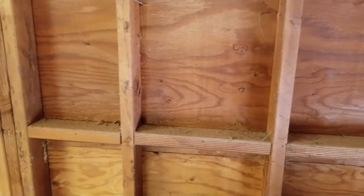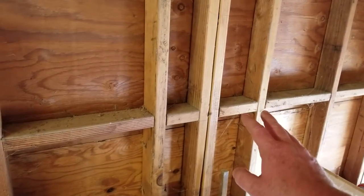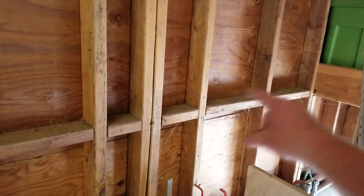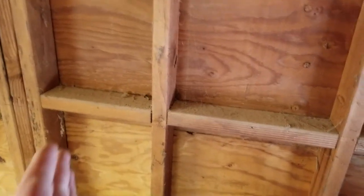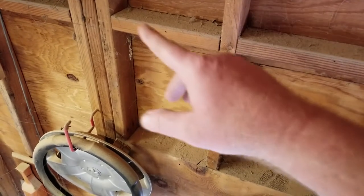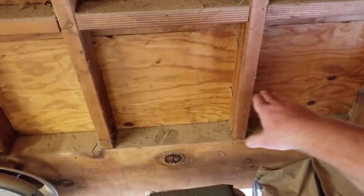This is how this is going to work. This is the first side, and then over here we'll do another one. I'm not 100% sure yet — we'll see how it goes on this first one; I might do it on each side. The way this works is we'll run a board from the outside here straight out, and on the outside here straight out. That way, your triangular piece that comes down is inside but then runs straight into here. That's what helps give it that perfect triangle, pushing straight against here — and then you run a board across here. That's your knee brace.